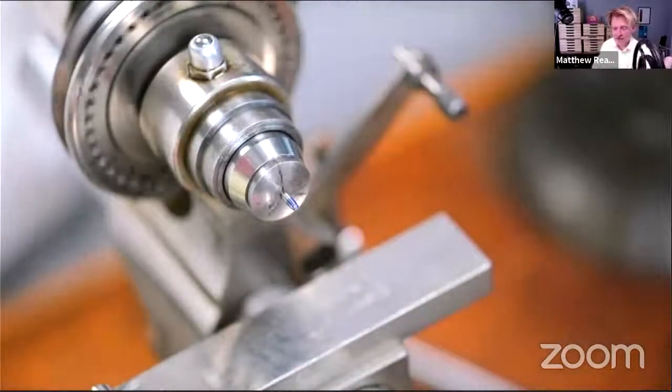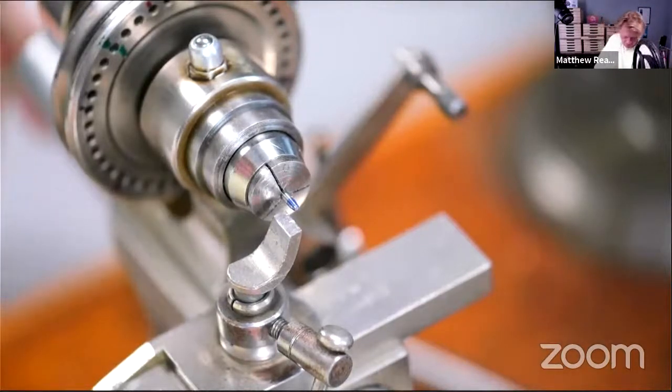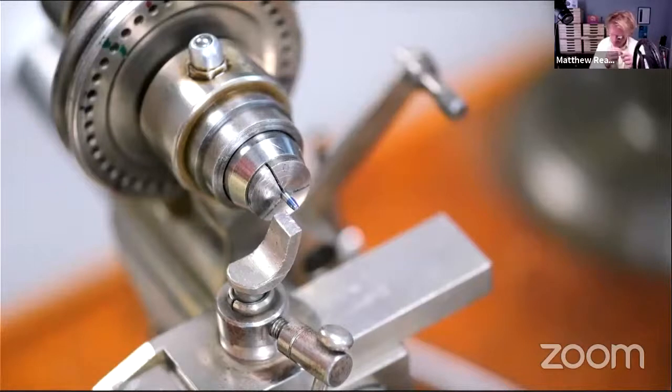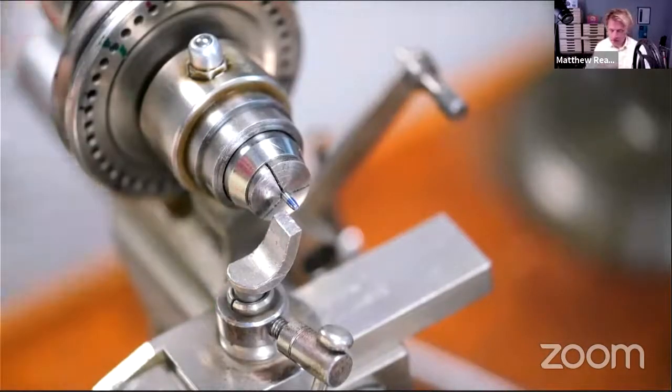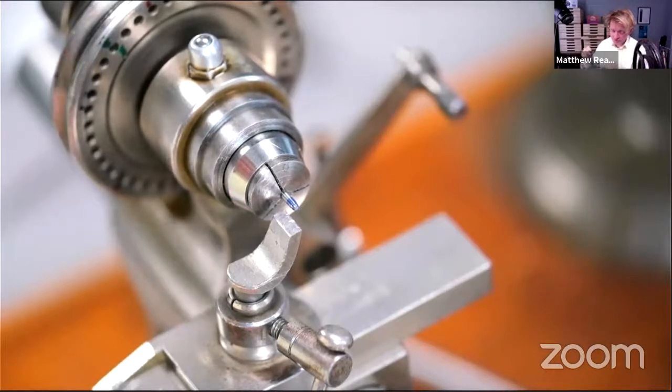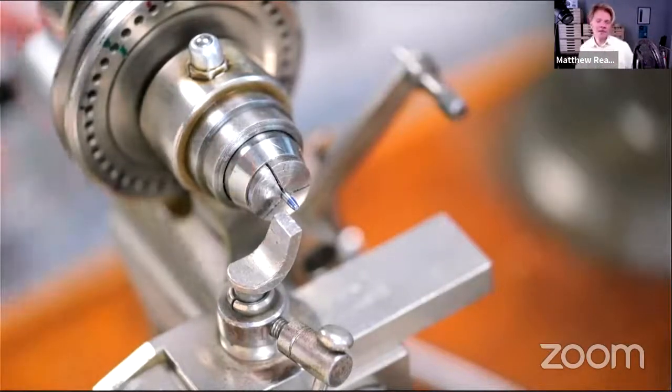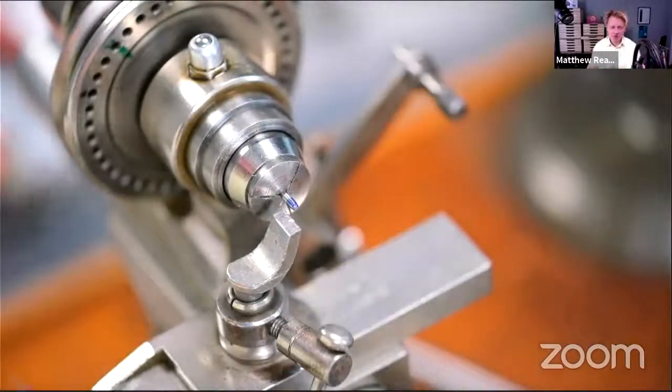Great. Okay, so I can start taking more meat off it now. Should have actually measured. In fact, I will do it if I can find the drill or something like it. Just measure how deep that hole was. I think it's about 2 mil. Let's have a look. Just put a little mark on and measure up. Yeah, it's about 2.25 millimeters. So that's good. For a 1.4 millimeter diameter hole, I'm pretty confident that that's enough. And that bit of steel, the drill I've marked now, is quite useful because it tells me how much I need to turn down.